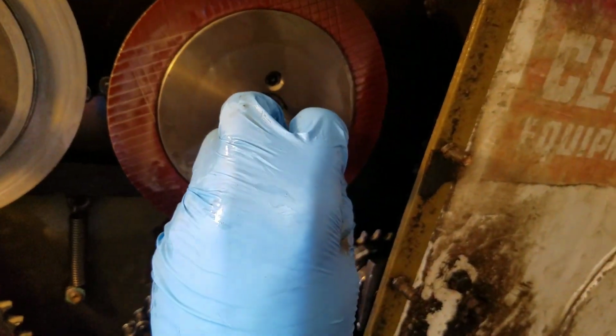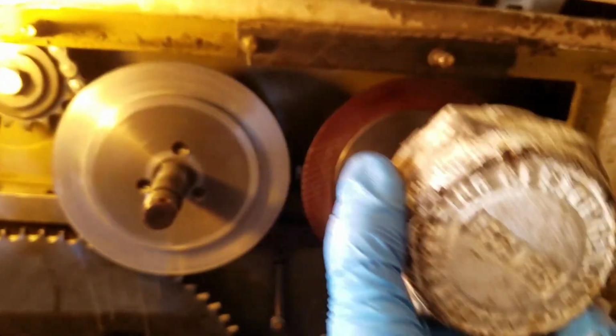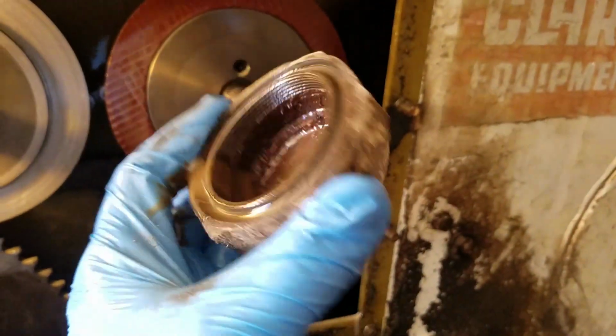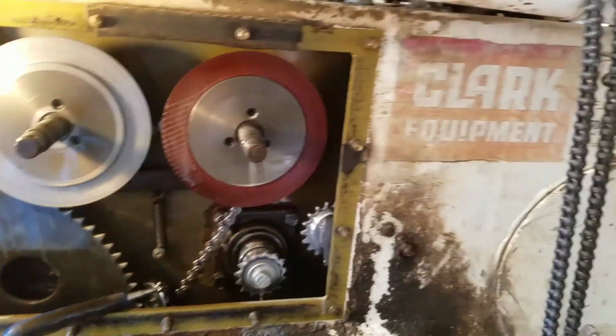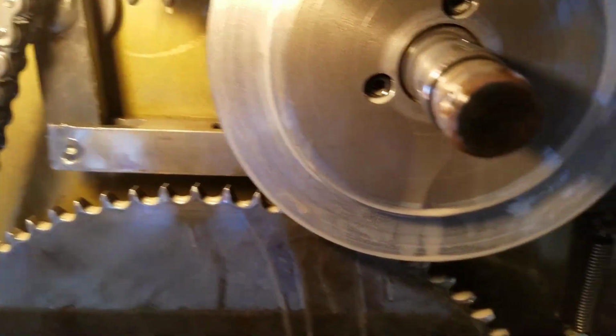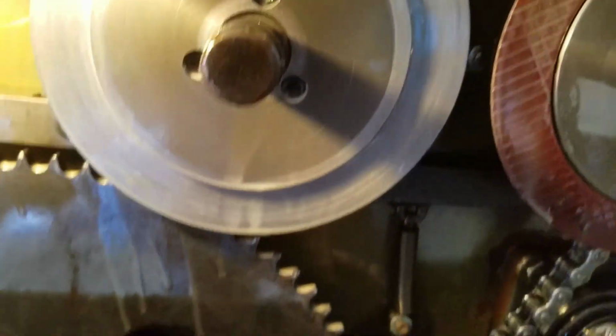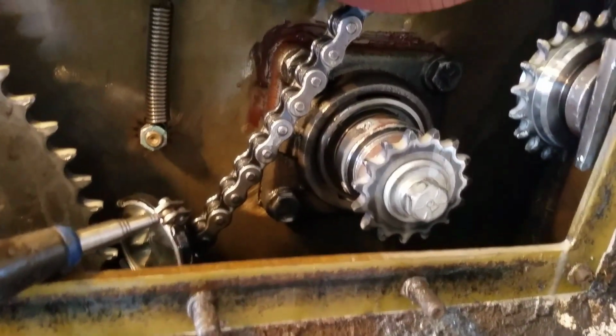And this is how you adjust it. See, these nuts are accessible. These castle nuts that go on here are accessible from under these caps. So this whole plate doesn't need to be taken off just to do your clutch adjustments. But we'll go through that on the next one after we get this apart. But this is a good time right here to check all your linkages and make sure all that stuff works. See, now that we got it all loosened, the lever moves all the way forward now, so there's nothing to push against, no clutch. So this is what you do, check all that stuff out in here and see what you're going to need.